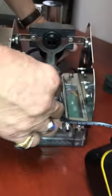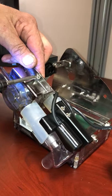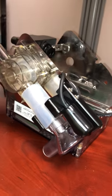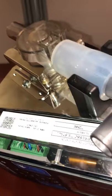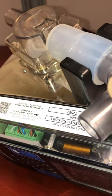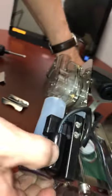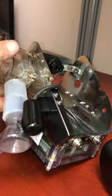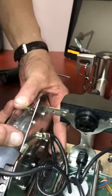If you're going to continue on to replace the diaphragm, get the milk line shut-off — essentially two screws. You should be able to disconnect the flow cell from the clip, like so. And you can manipulate the elbow whichever way you need to get it through the back hole.